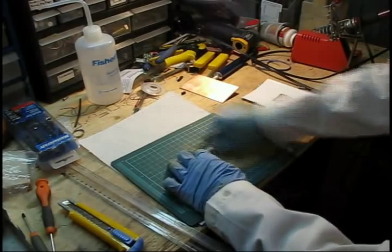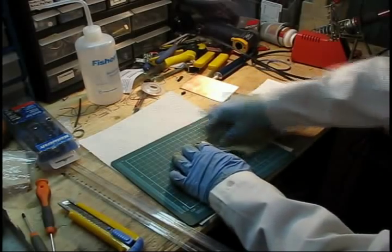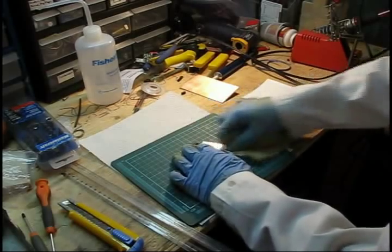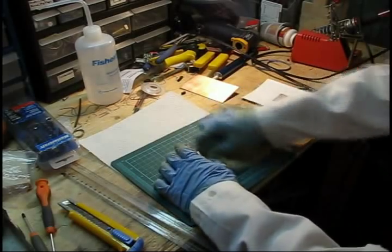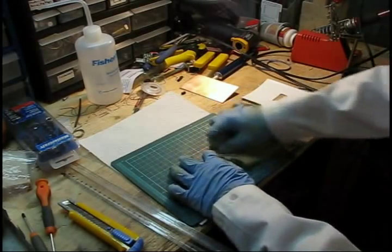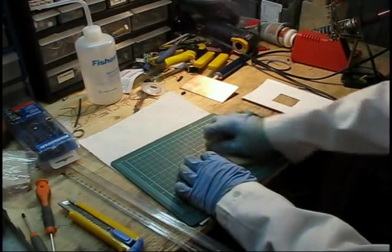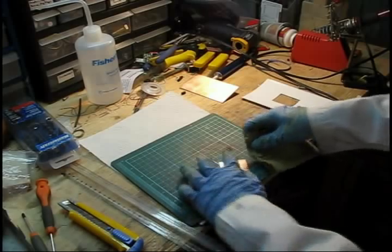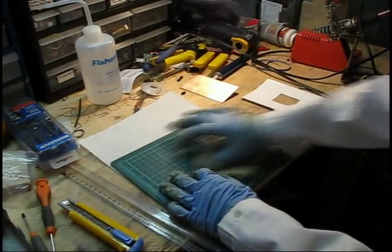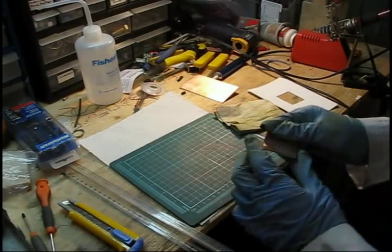You can use lower grit, however if you use too heavy grit sandpaper it will wear out really easily and just cause more of a mess, as well as if you're using very thin copper clad you'll wear through your material pretty quickly. This is also when you want to use a respirator. If you're using extremely fine sandpaper you're going to kick up a lot of dust during this process, which I'm actually wearing right now — you can't see because I'm off camera.